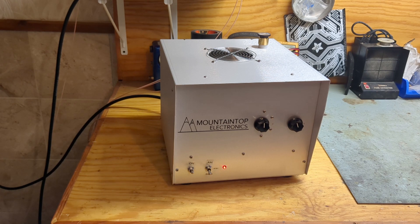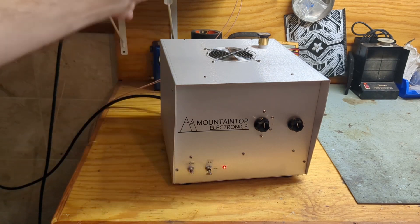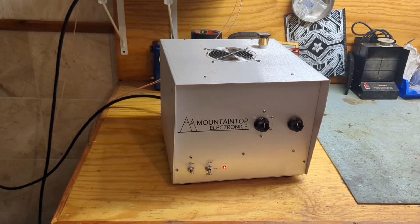This amplifier does not have any meters on it — you do not have a plate voltage or plate current meter — but I gave you value back in the box because you have a 300 milliamp continuous duty power supply. You have auto-start, so you do not have to set a timer when you turn the filament on to let the box warm up. You just turn the box on, that red light will come on after three minutes and turn the high voltage on automatically.